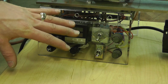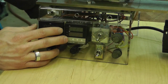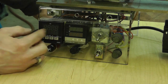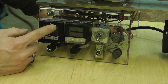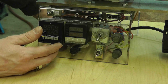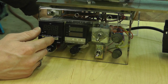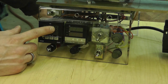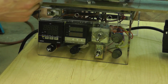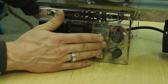What I'm going to do is use a couple of external relays on here, and set them so if one of these two temperatures drops below a certain point, it will stop turning the auger bit. So if something malfunctions, the auger bit won't know it, but the controller will — it'll know there's a problem with the temperature, or wire burned out, or resistor burned out, and it will stop the process.